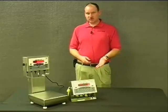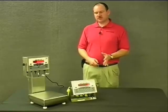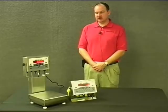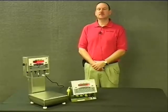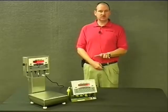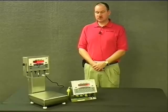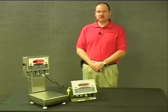These units have four modes of operation. The default mode shipped is range mode, where the operator sets an over and under value and everything in between is acceptable. There is a target weight mode where the operator sets a target within an over/under window. The target percent mode is similar but the window is defined by percentages around the target. Finally, there's a negative check weighing mode, where the product is already on the scale and you remove product to reach a target.